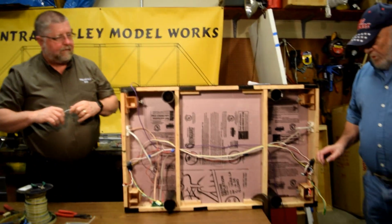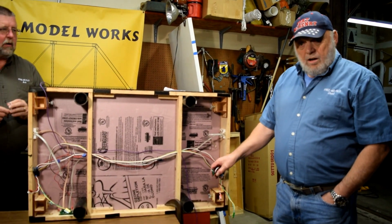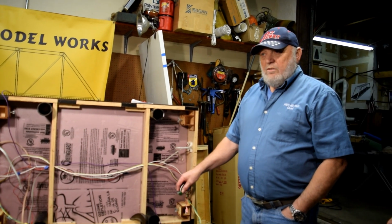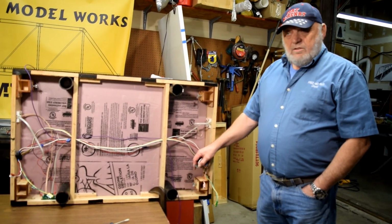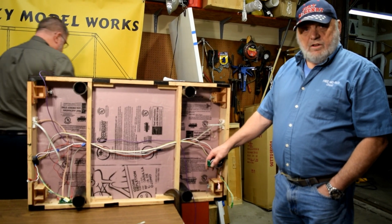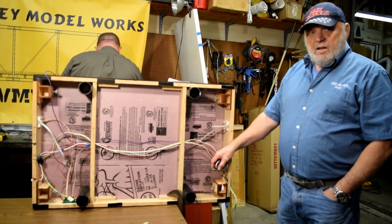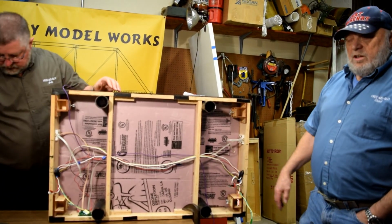And I want to mention one more thing. In this case, we used a BD20. There are other products that you can use. We like BD20s. We use them for a couple of reasons. Most of the other products need to have power, and the BD20 doesn't need to be powered if all you want to do is just current detection. So I just want to mention that there are other products, but we just happen to be using the BD20 for this particular install.